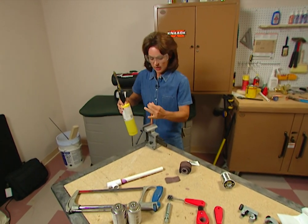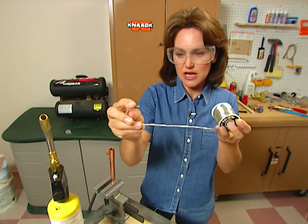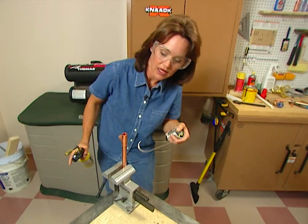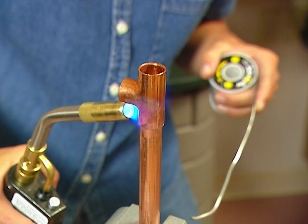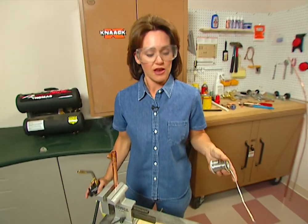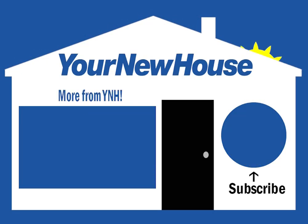So we're going to put this on. On your solder, pull it out so you have yourself enough length to work with, and if you'll bend it up at the end, that'll make it a lot easier. The way to use your torch is you want to heat one side of your tubing, and when it's heated enough, you can place your solder right under the joint and it should draw it up into the tubing. Then just put a little bit on the other side — a little bit goes a long way. A lot of people make the mistake of putting too much solder, but you just need a little bit and it does go all the way around the tubing to adhere. And I'll see you next time.